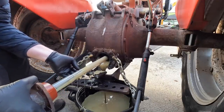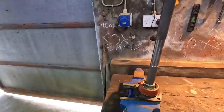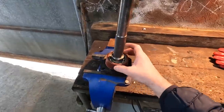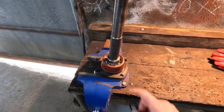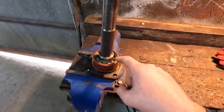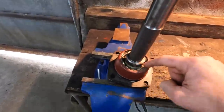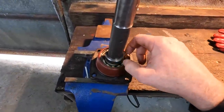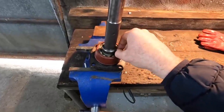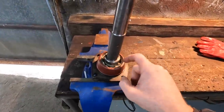Oh, that ain't a great colour - that's definitely not a good colour. Lots of milk. So this is our PTO shaft - in here we have our seal and our bearing. The bearing is actually turning very, very freely and I don't hear any sounds it shouldn't make, so I don't see a reason to change that. If it's not broken, don't fix it. How we get this seal out is there's a little circlip in here - I have to get a screwdriver in and try to work it out. It's one of the older types, not the new style with two holes for pliers. It can be a bit of a nuisance to get out.